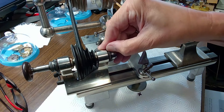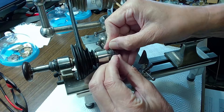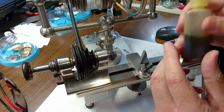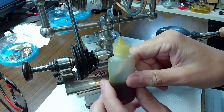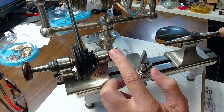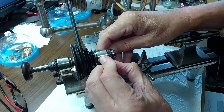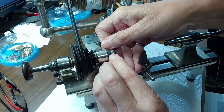This is the locking nut for the spindle, and it comes off — you can move that out of the way, and right in there is where you put oil. The type of oil I use is 0W20 synthetic oil, and I put it into a sewing machine oiler. I've been using that for years and it works fine. Once you put the oil back in, you put the ring back on — it's a friction fit split ring. Put it on and move it slightly out of the way so the hole is not showing, and do the same with the rear one.